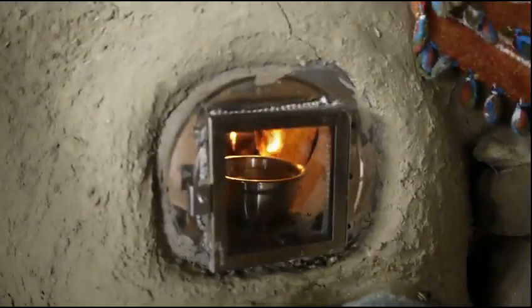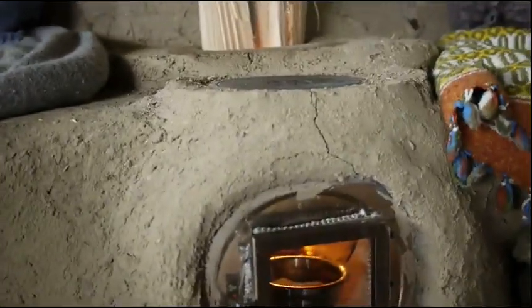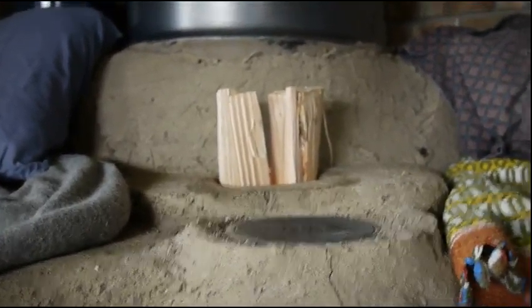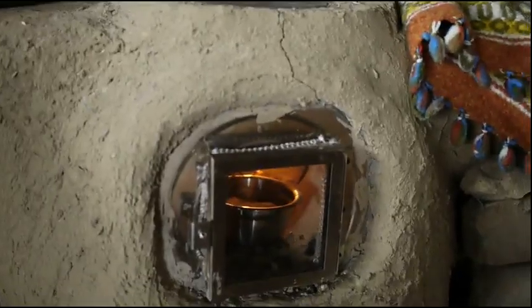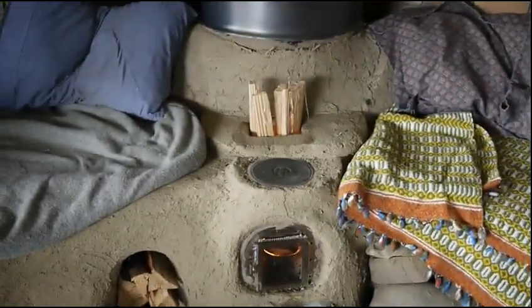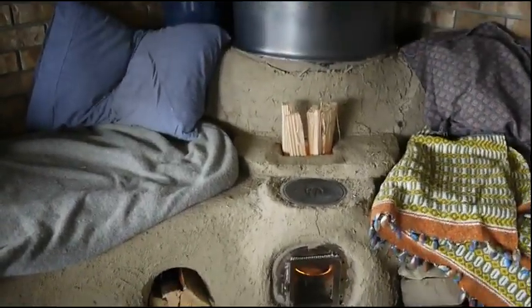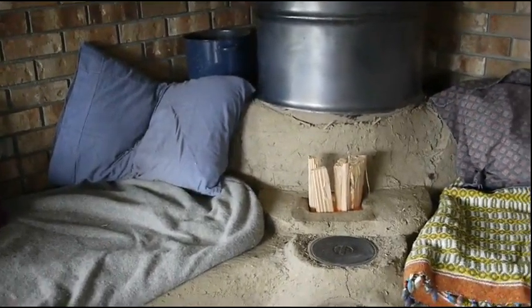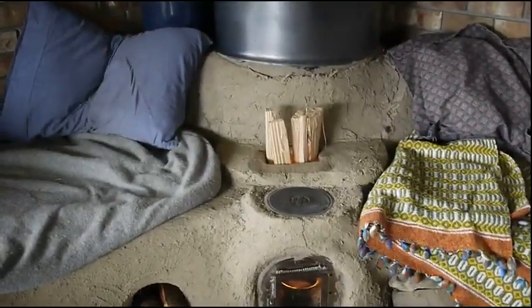Temperature down here I can regulate via flow through the window door, and I can also help control burning up there the same way. Sometimes when the stove's really hot — if it's really burning, which I don't usually burn it that hot — if it is burning that hot, it will start pumping if I have this shut down too much. That's because I restricted the airflow at the feed too much, kind of to compensate for having this. It does take a little tuning to compensate for a sort of lack of seal and for the ability for air to reach the wood from two places. But with a little experimentation and tuning, you can really end up with a very nice running stove. This thing is just running wonderfully with the latest restriction on that feed tube.